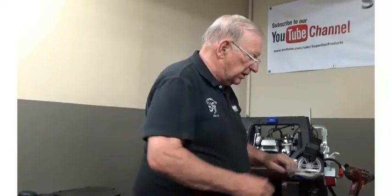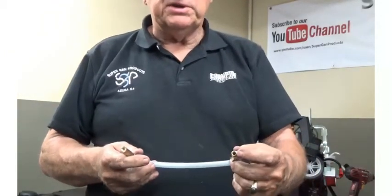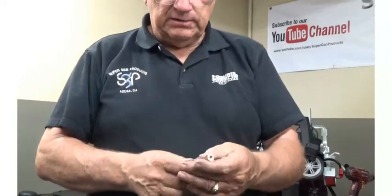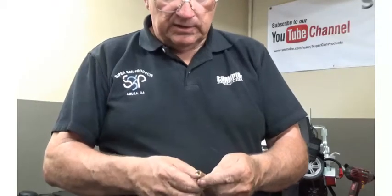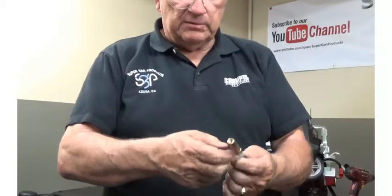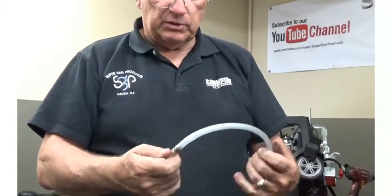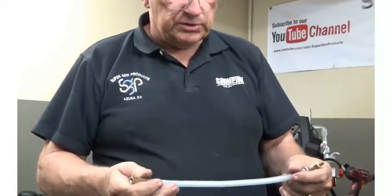This particular Lazy Man's oil drain has a 10mm thread and a 12mm socket bolt head on the fitting. On the other end it's got a blind plug. The thread is not used on this model — it's used on one of the other ones that are clamps we use on the tubular frame. But by relaxing the spring clamp, you can pull this plug out. It's a solid plug, or we'll call it a blind plug, that prevents the oil from flowing out when you're using the generator.